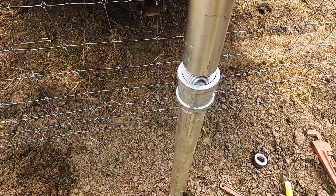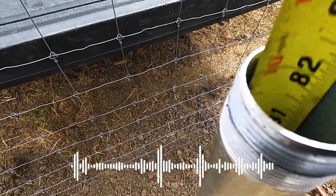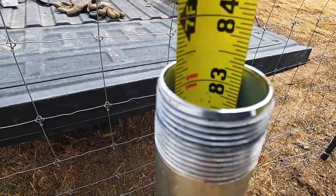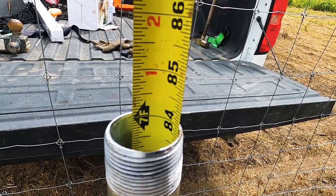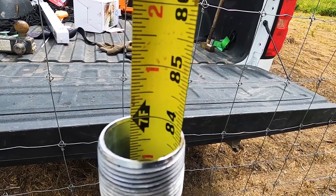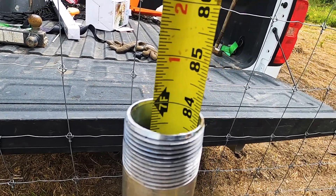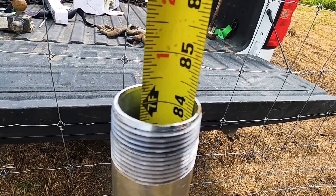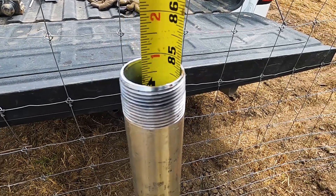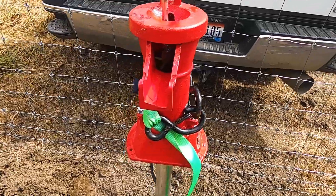I just stopped — we're about four feet from ground level. Listen for this: that level right there is at about seven feet of pipe. I've got a three-foot drive point, 10 feet of regular galvanized inch and a quarter pipe, and then a one-foot section — so realistically 14 feet total. At about halfway down I've already got water, which means I'm below the clay layer. Now I can start priming the pump, get it soaking in water, get these threads sealed up, and get the pump piped up on top.